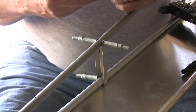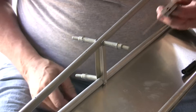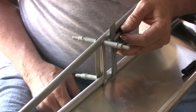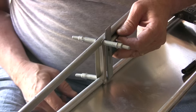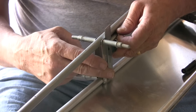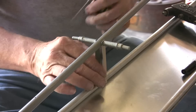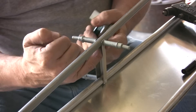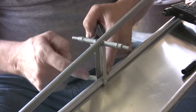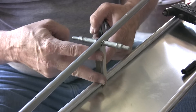I don't know how well this will show up on video, but I've got a small precision machinist square. I place it on the bottom rib and take it right up against the edge of the bracket here, just to make sure that I'm square with the bottom rib. The inside bottom curve of this bracket on both ends is sitting right up flush against the tubes without spreading them out or raising the height any.